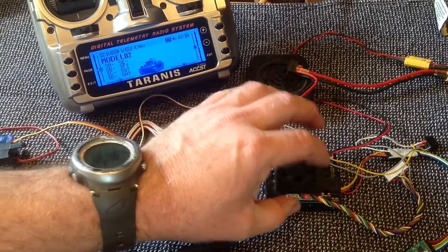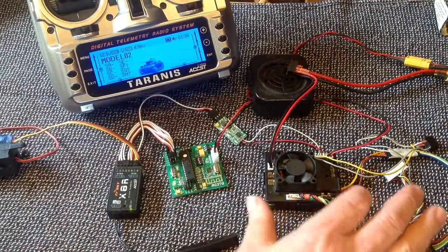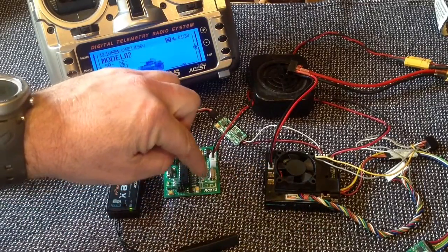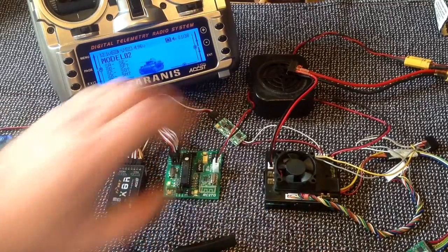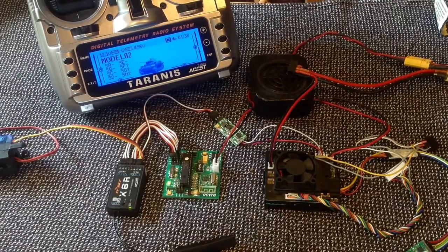Now, instead of that binding to your old Taigen radio, as you can see, that's not even turned on. This unit is now bound to the transmitter on your RC2TG board. So this is now bound to that. To turn it on, we use switching channel number 5, 100%.